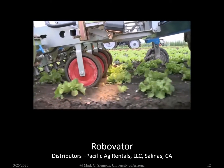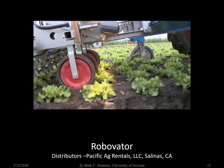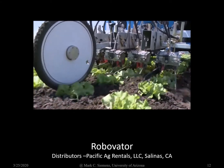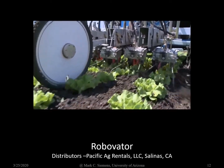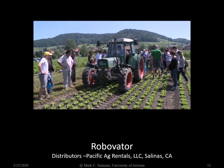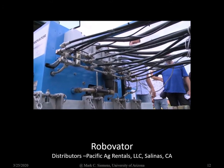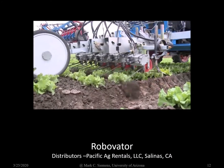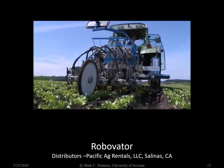Digital cameras record the position of the lettuce plants in each row. A freely turning wheel equipped with sensors on the back of the implement transmits speed and working depth data. With this information, the computer in the cab digitizes the identification of the crop plants in the rows and converts the data into control signals which cause the cultivator blades to move around the plants. Thanks to the onboard electronics, the height control and sideways steering of the entire implement are fully automatic.